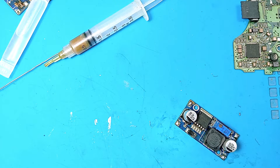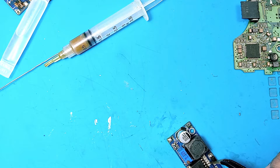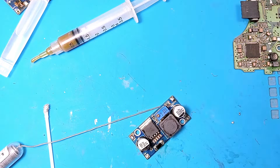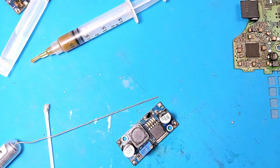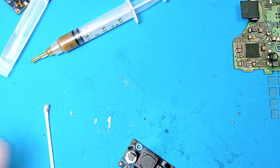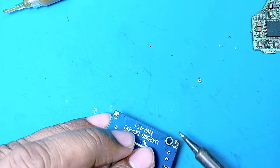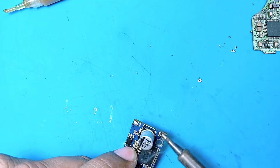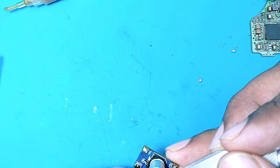Apply some soldering paste, then perform the soldering process. We made solid solder joints. Now checking that all pins are properly soldered, removing extra solder. The board is cleaned up — there's a small lifted strip on the board but it should still work.